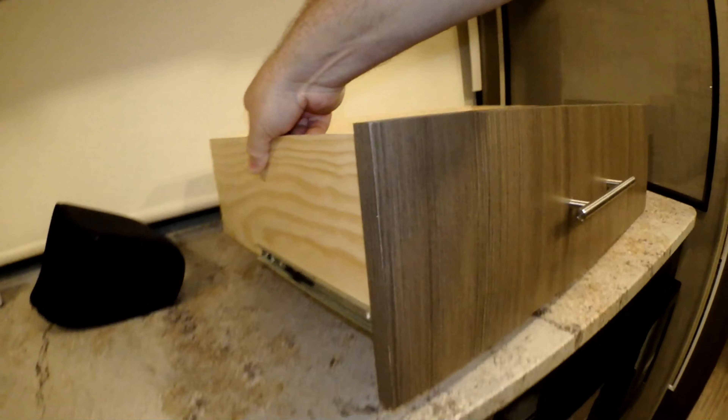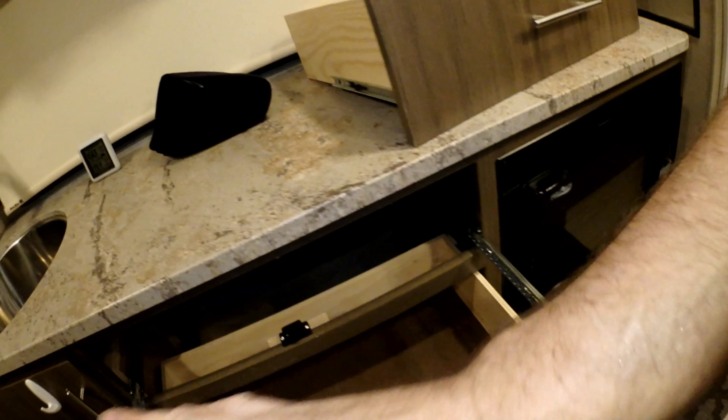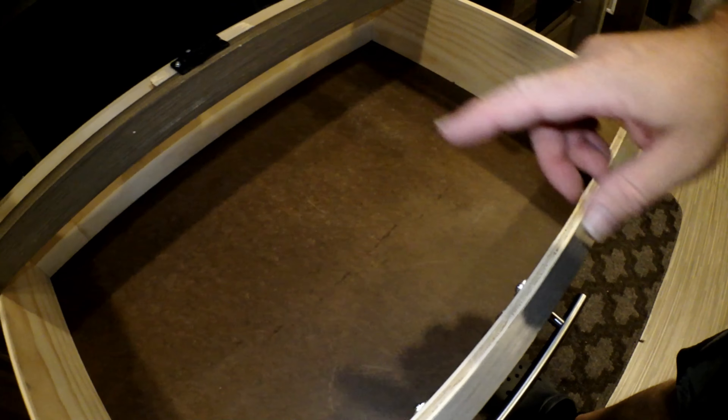You've got a little bit of adjustment here, so when you slide the drawer in you can adjust the slide from side to side. I'm probably going to come back and put some extra screws in here just to secure it better — not really too happy with that process. The hardest part of this entire job is cutting this channel. If you've got a table saw, it's basically two passes of the blade. This is some MDF board I had down in the shop from another project. Beth always puts drawer liners in, so all this is going to get covered up. You can see right here this is the original plywood they used. They used plywood; I used pine board, but it's the same thickness. I glued all my joints so it's going to hold up really well. All the latches stayed the same.